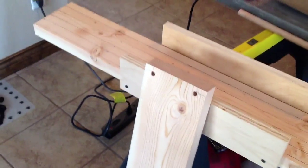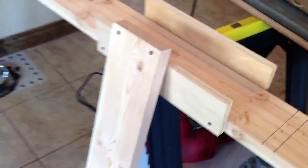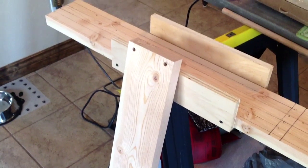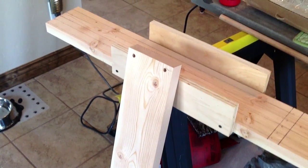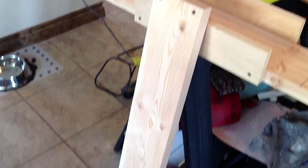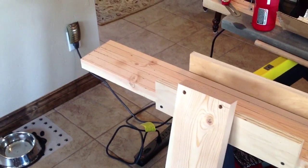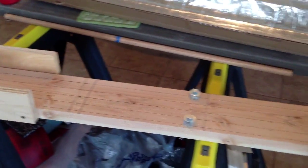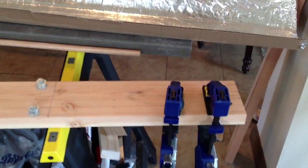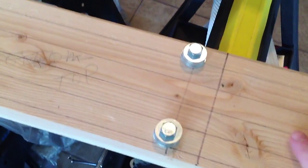So what I did was I took the bolts out. I built it using two by six hardware instead of two by four — you could use two by fours, by the way. I only used a two by six because I had one that was eight feet long. The flattening board itself is a three foot piece of two by six, and the actual jig itself is five feet long, also a two by six. Basically, instead of using the top board with the adjustable nuts, I drilled two holes into the bottom board, as you can see here.